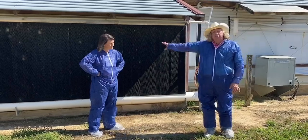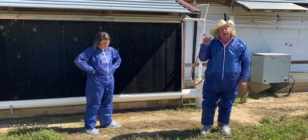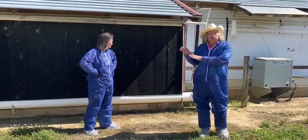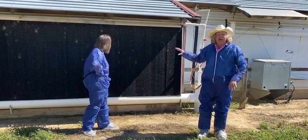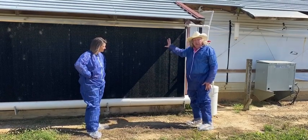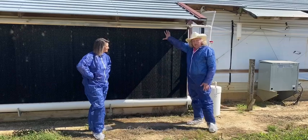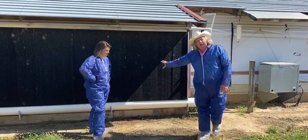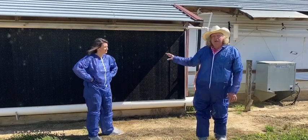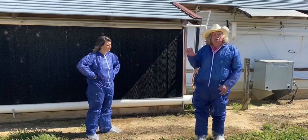We can either run water through this pad or not. They are called evaporative cool cell pads for a reason — they do need to dry out. The water needs to evaporate off that pad. You don't want to keep this pad wet from nine o'clock in the morning until nine o'clock at night. It works better if you trickle a little water through it, let the water shut off, and let that pad dry off a little bit. If you keep it wet all the time, the humidity level in that house is going to be 90 to 95 percent, and that's hard on those chickens.